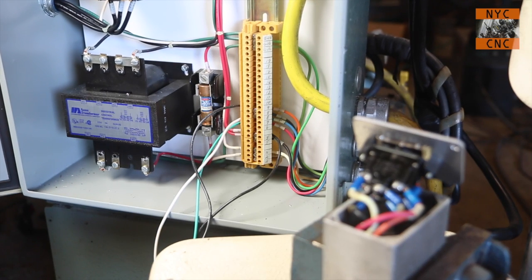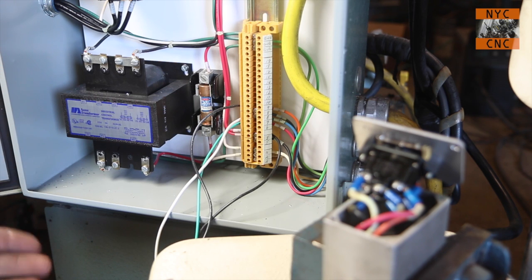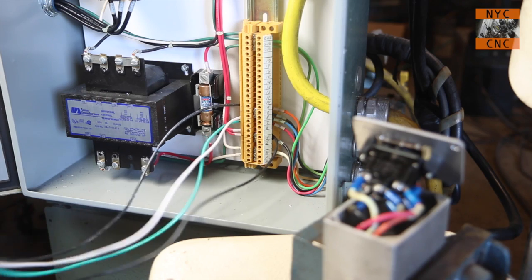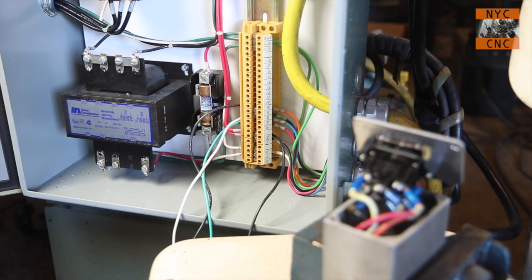So when you look at the wiring here, you'll see it's that same thick gauge stuff. So you can't just use 20 gauge wire. It would probably burn up or create a fire. I had a power cable laying around, just an extra computer cable, and I just stripped the sheath off of it, and you've got 3 nice pieces of wire, and they seem to be similar gauge to the stuff we're using, so I'm okay with that. Again, consult an expert if you're not.